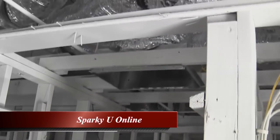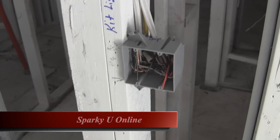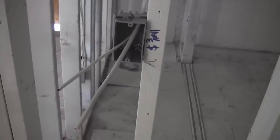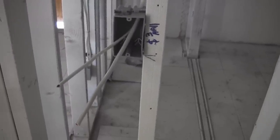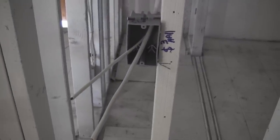On a three-way situation, we're going to be mounting the recessed cans up there. This is my power end, so I'll be picking up my power, and then I ran a 14/3 over and down into this switch here. This end will be the switch leg, so I need to have a neutral over here, and I've got my black and red in that 14/3 as travelers. We'll go ahead and make this up now and then I'll show you the cans.